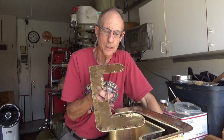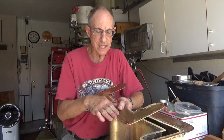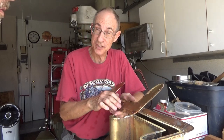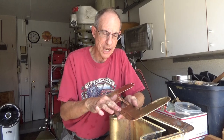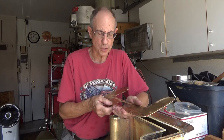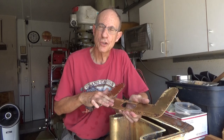I did not use a drive rivet here because I had access to the back side. Those are all flush on the back. I have a template that I used, that I laid in here, that I drilled through, and then I spun it back over — the reason for marking top and bottom — so that I knew I was on the back side. Then I countersunk all those holes with my milling machine to get the precise same depth across all of them. With my 3/32nd rivet, which was 1/16th of an inch long, I was able to compress that and make it fairly flush to those countersunk holes.